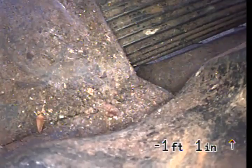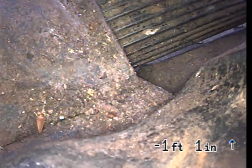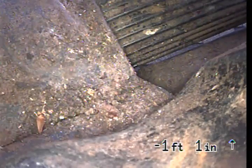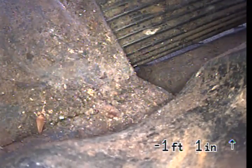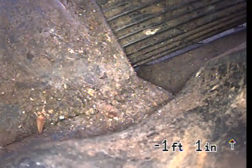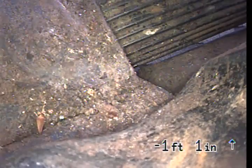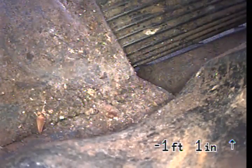This concludes the sewer scope video inspection. In my opinion, the sewer line's in failing condition due to at least two positions that had roots growing through the concrete line in the front yard. Again, those are both marked and about 4 feet deep. Also, there could be more unknown issues past the point my camera could reach.